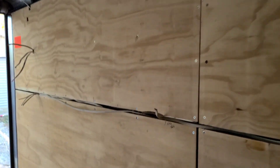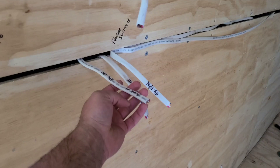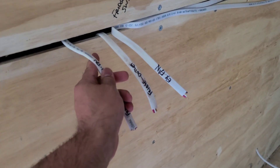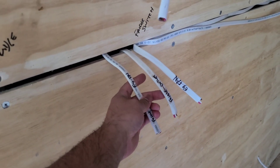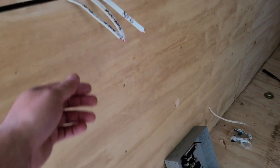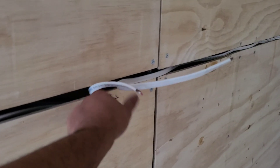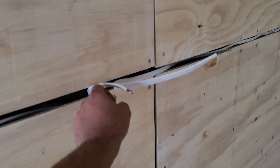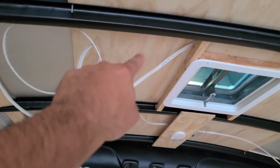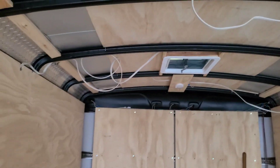On this side, just to recap: this is for the fridge and for the exhaust fan. The exhaust fan has 2.9 amps; a typical 4-foot-1 fridge is 8.3 amps. All three of these go together. This exhaust fan power goes right here — it's a rotary dial that gives the fan a high and a low. Then this one goes all the way up top, and that's where we cut the hole for the fan, going straight up into a switch up there.